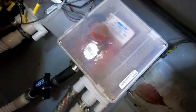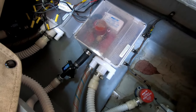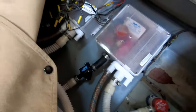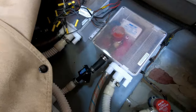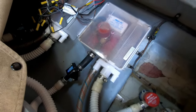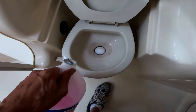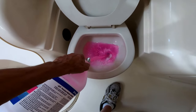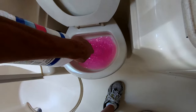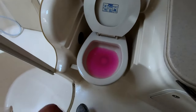We're all pinked up, so the gray water system — two little sump boxes — is done. The sink drains on the boat just drain right over the side, so there's no sump for them. The only thing left: the head tank — the black water system — is empty. I'm going to pour a gallon of pink down each toilet and flush it through, to make sure absolutely no water is left in the tubes, the pump, or the hoses, and there's a decent amount of pink in the tank. That's the last step and then we're done — this boat is all set.